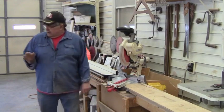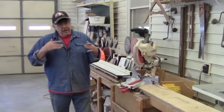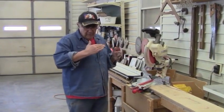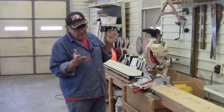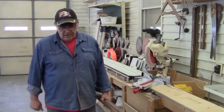The way I do it, I'm going to cut my first cut. It's going to be a 45. And then I'm going to take a scrap and play with my angle until I make sure it's mating and fitting my case or ceiling or whatever I'm doing. I don't use my good stuff. Something to bear in mind. Let's go to the table saw and take a look at this.